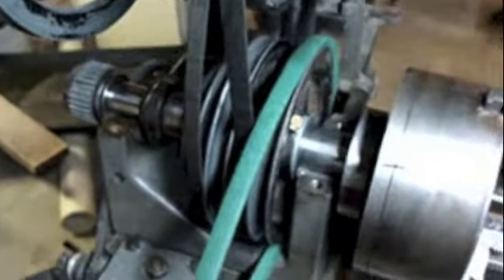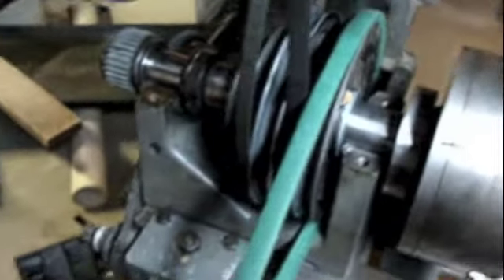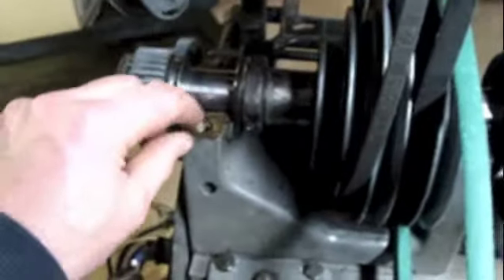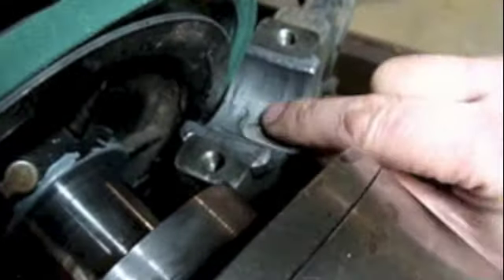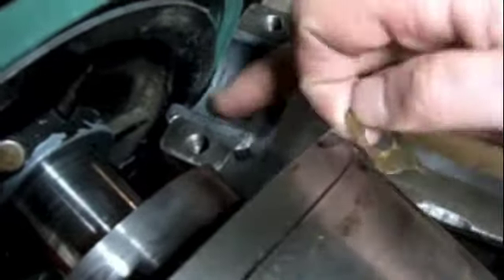Anyways, it's driving me nuts. I have to take these caps off again and pull the spindle — I have no idea where that shim fell down to. This is the two shims on this side; I only had the one on this side, and now I have zero. It fell down into the bearing. Luckily, I didn't torque it down.